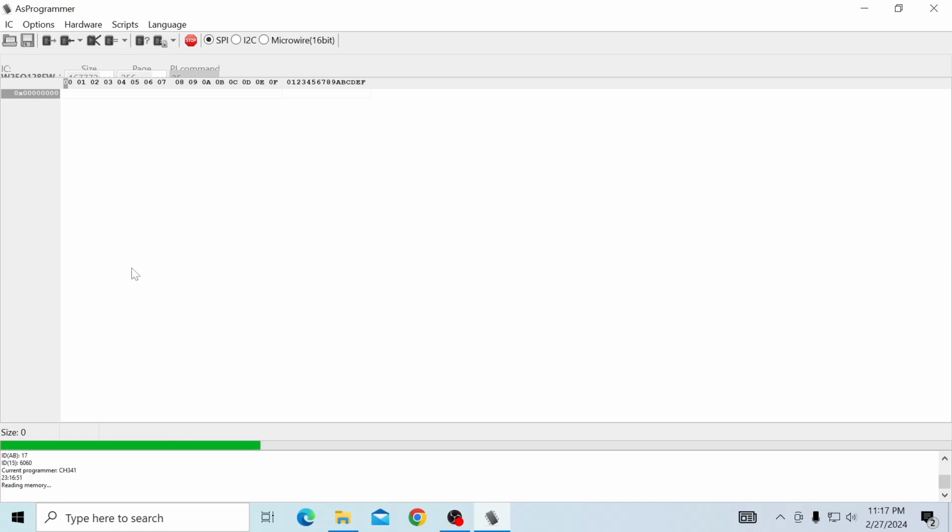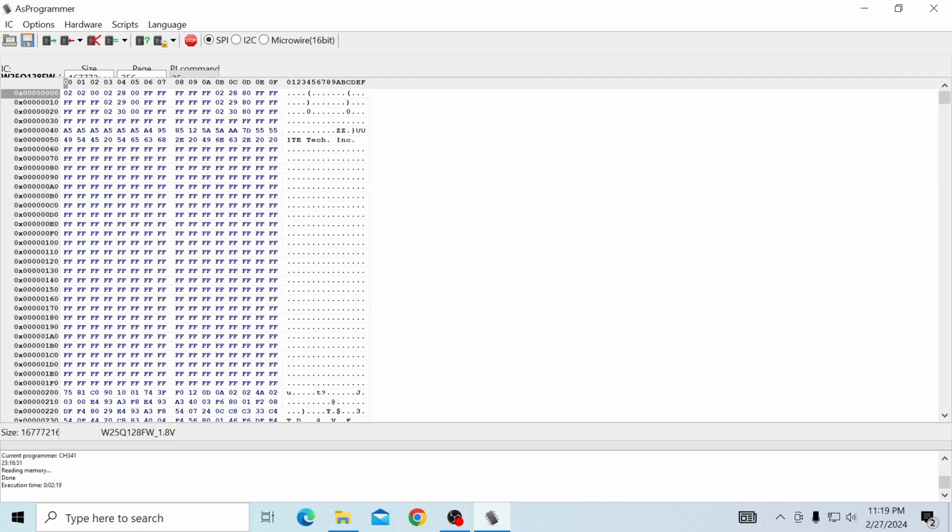If you already have a clean BIOS, you technically don't need to do this. You don't need a corrupted BIOS. If you have a clean BIOS, you can actually skip this step. And there you go. That is your BIOS. So if you corrupted your BIOS, meaning you bricked your Steam Deck, you need to save this. And if you just want a spare copy and it's not a bricked Steam Deck, you can go ahead and save it.